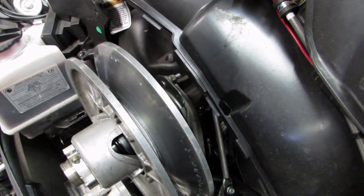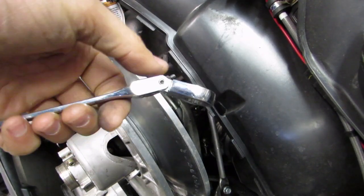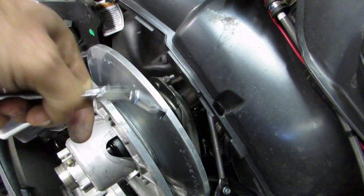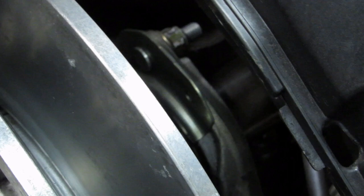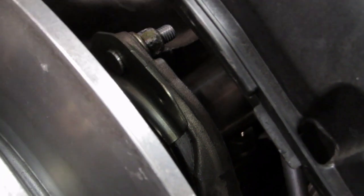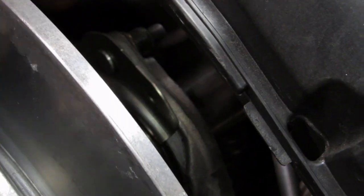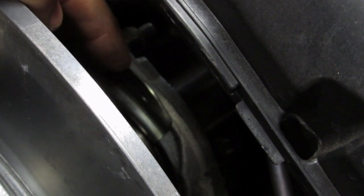It's real easy. You get a ratchet wrench, 13mm. It helps if you have one that you can lock at an angle to get in here. There's a bearing retainer — you can see it in there. Get on that nut and loosen it up. Then you're going to take the nut off — try not to drop it in the belly pan. Then take this retainer off. That's the first step.